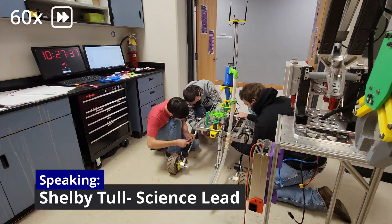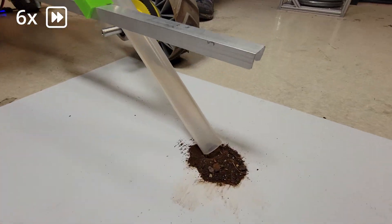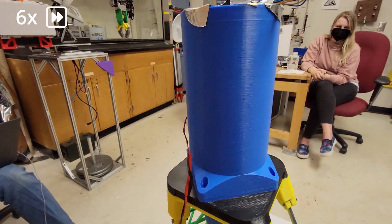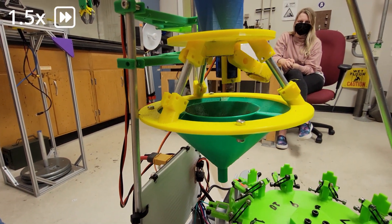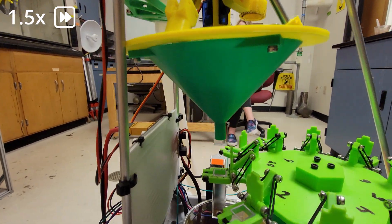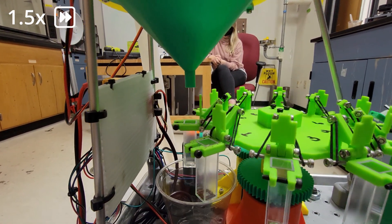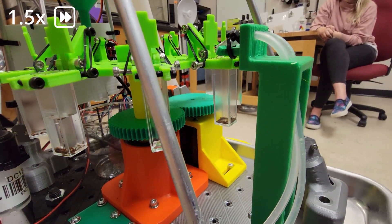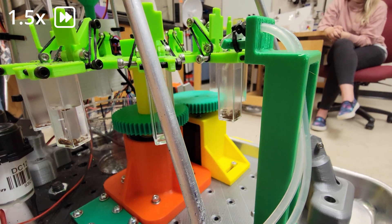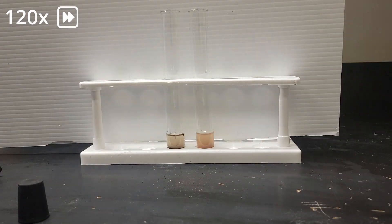For the science mission, our onboard lab uses a vacuum with a cyclonic separator to obtain soil samples. There are three measuring cups and funnel sections on the bottom of the cyclonic separator, one for each expected soil site, to reduce cross-contamination. The measuring cup converts an imprecise amount of collected sample into a precise amount by volume. The soil is added to a cuvette.